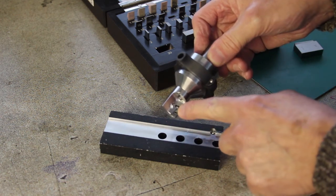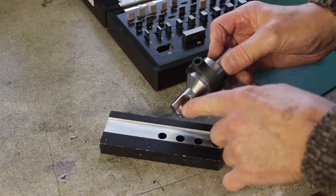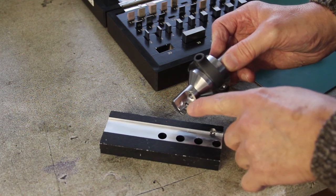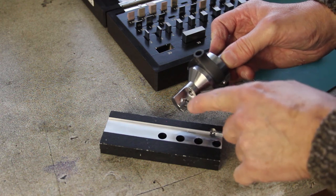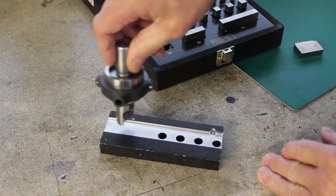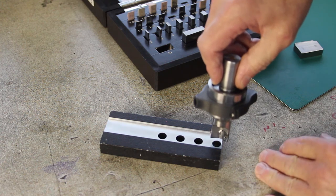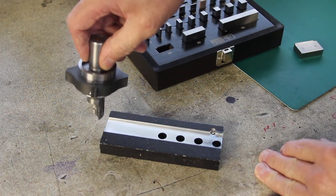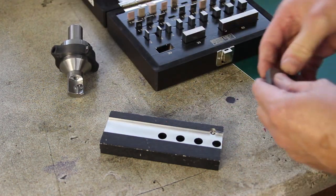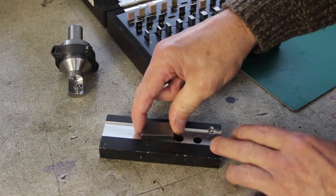But if you watched the last video, you saw that machining the actual pocket position, I did it over 2 days. And I don't think my mill picked up the exact same G54 center position for cutting, so that had moved. So consequently, we've just run down this scrap aluminium part, moved over a millimeter, come back, moved over another millimeter the other way, and gone back, and then repeated the operation as spring cuts. So this width of this channel should be 20 millimeters.